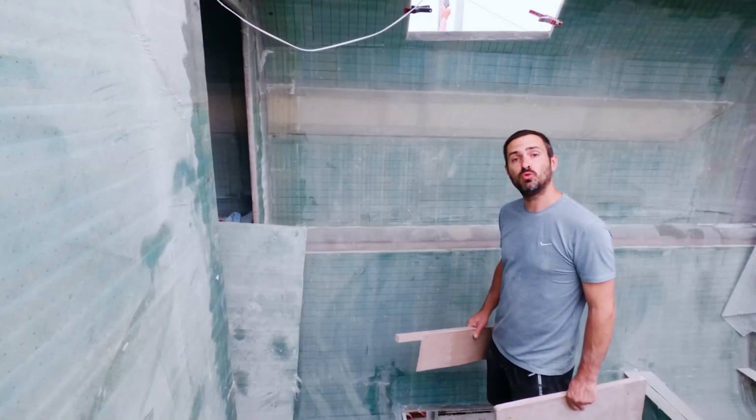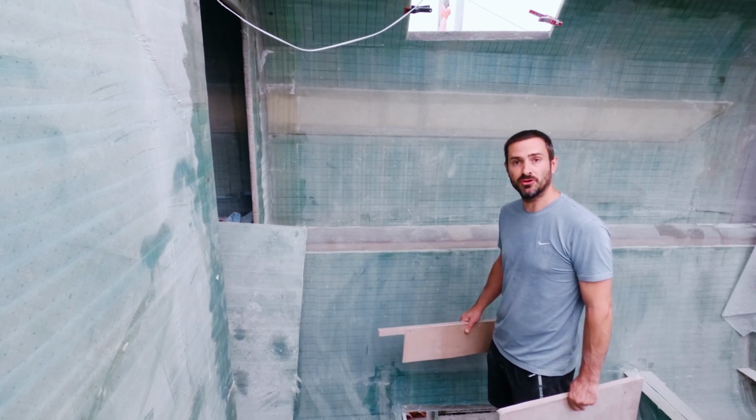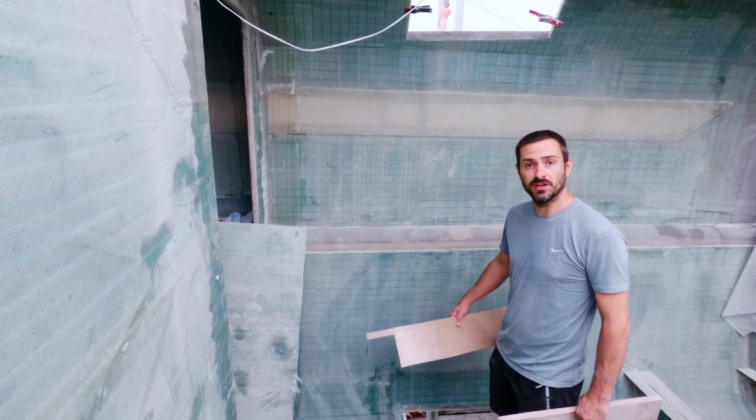Since there isn't much room between the hull and the daggerboard case, definitely not enough room to be able to do a proper fiberglass job, what we're going to do is make fiberglass flanges that can bond the daggerboard case with methacrylate.